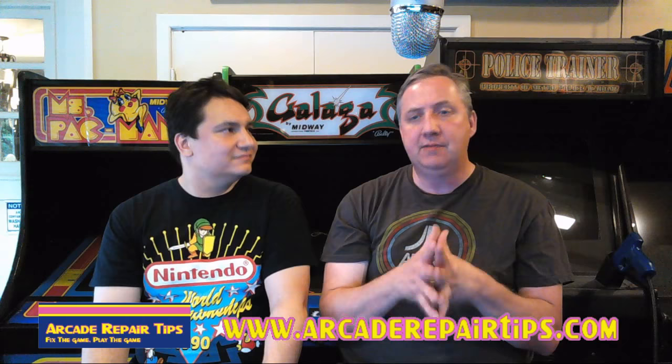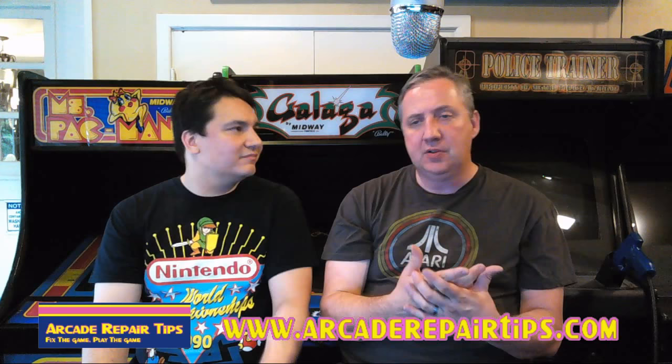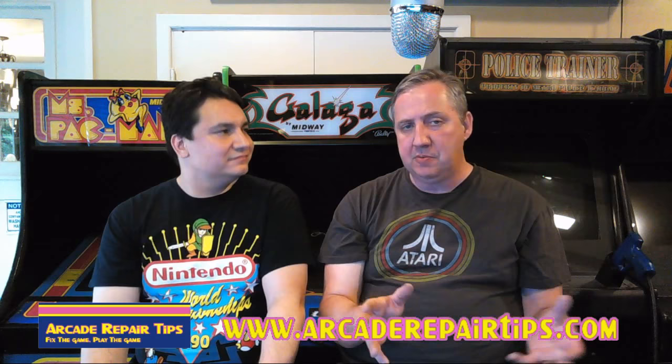Based on our research, it looks like he may have a bad video RAM, which is very common. An IC chip at location 5B will fix that. But I'll highly recommend, because he probably wants to keep his Galaga, since not very many people are buying them to resell, to go ahead and get the renew kit from Raymond and try to put that in there. I bet that will take care of all those issues.